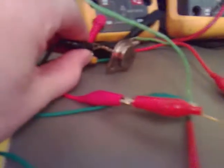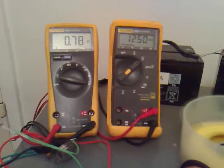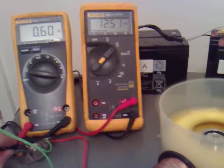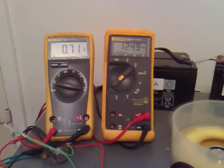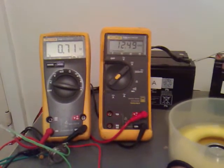Let's bypass the little resistor down here and see if we can get any more out of it — 0.78. The coil goes straight into the base of the 2N3055. Putting that to the other side again: 0.71 amps, nice and steady at 12.49 volts.